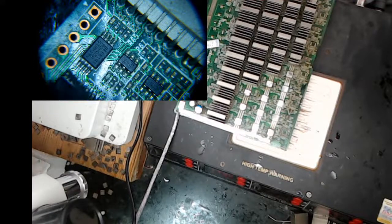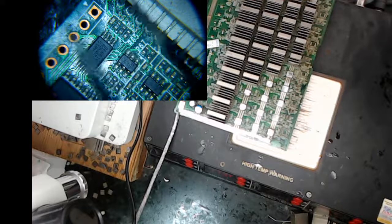So I found out after tracing, see this appears out of the back side of the board right here. I think it appears right there. I can't remember. It's either right there or right here. I can't quite remember this resistor. It goes through this resistor out of this capacitor. It's kind of weird. This guy's grounded because he's cleaning up the signal, and this guy's a 33-ohm resistor, and then it goes to the other side of the board, then it comes back to this side of the board, and then it goes down there. It's kind of hard to find.